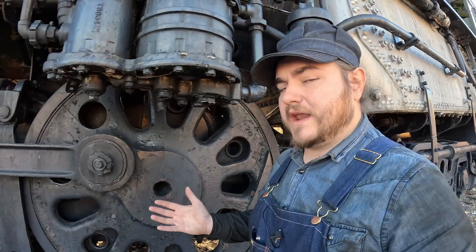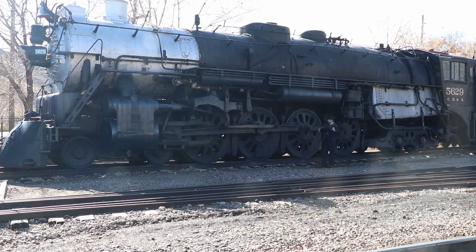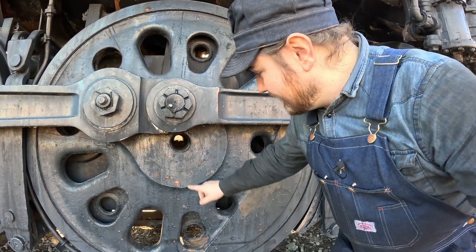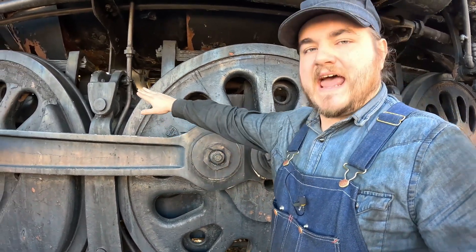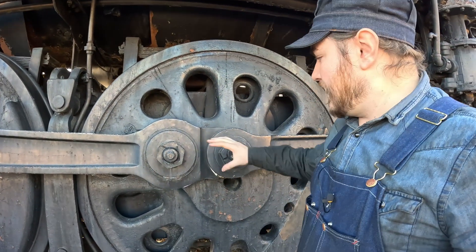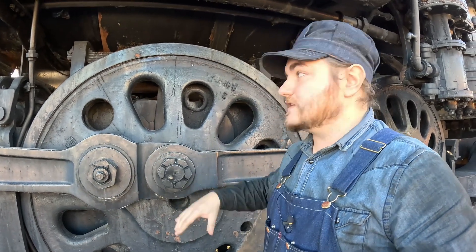Now if we take that concept from 191 and apply it to 5629, we can draw an interesting conclusion. Though obviously 5629 is a significantly larger locomotive — standard gauge, mainline, passenger, and all that — we can see that we have a wheel center right here, and interestingly on 5629 they're hollow and you can see all the way through them. But the wheel center distance to the crank is actually less than halfway to the outside of the wheel. It's a much smaller distance when you think about the ratio of crank torque arm versus the actual wheel diameter itself. And that's the piece of the tractive effort equation that gets a little confusing: it's all about the ratio of the crank to the wheel size.